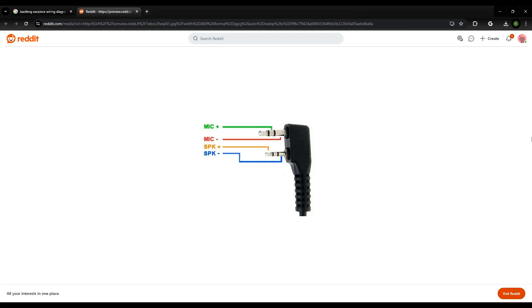When you open up the cable you'll find four wires. I recommend burning off the fiber wrapping with a cigarette lighter after splicing, since these cheap wires use very few copper strands and bulk up with fiber instead of insulation. That leaves you with four tiny wires. To avoid shorts, strip the wires at different lengths so they can't overlap and touch each other when you reassemble everything.